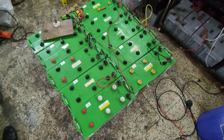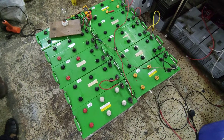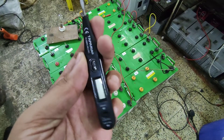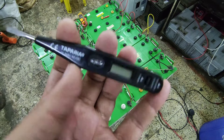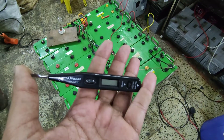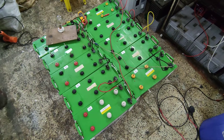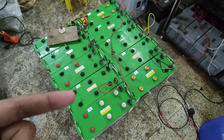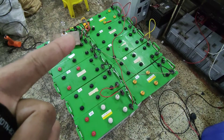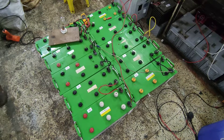Here is the setup I am using. You can see a set of batteries with a combined voltage of 120 volts. Let's see whether this can detect it, because it claims to work with 20 to 250 volt DC. There are 10 batteries total — a set of 5 connected in series, and another 5 connected in series on the top side — combined producing 120 volts DC. All the batteries are at 12 volts each.